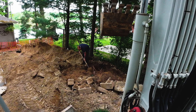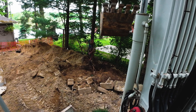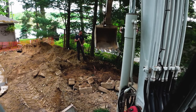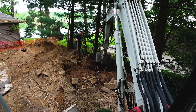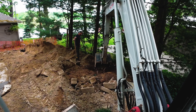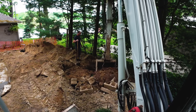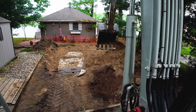If you ever hit one of these lines, most likely the guy down there hand digging is going to get some dirt in his face and eyes. It's going to smell like rotten eggs real quick and it's going to get pretty loud. We've got a bunch of tree roots in here to pull through — and you've got to be extremely careful because those tree roots can grow around that gas line. The whole time he's pulling, I'm keeping an eye on everything. Pulling extremely slow, you could reel that gas line right out of there with the tree roots sometimes.